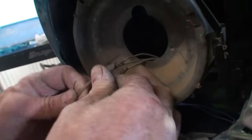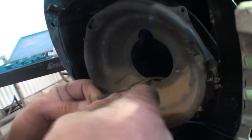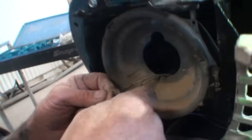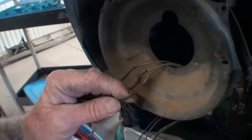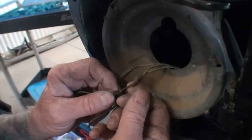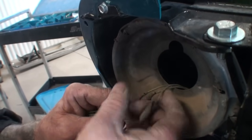If you look real close, like Minnie said, these wires are spliced together but they're taped together. That means underneath these wires — I'm going to go ahead and take one off. This is old cloth tape. I bet you this is just twisted together. Oh yes, there's your circa-1970 wire connection.